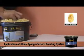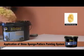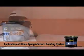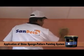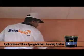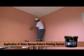Natural sea sponge is used for this application. The sponge should be dipped in shine finish and get equal amount of paint at each, giving design patterns by hitting on the surface with systematic strokes. A diagonal way should be followed on the surface during the application.